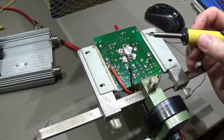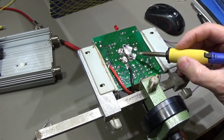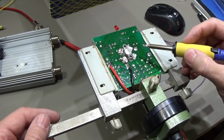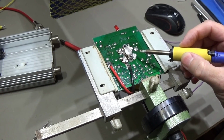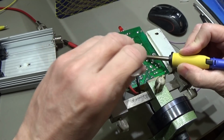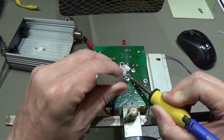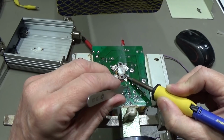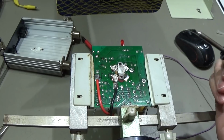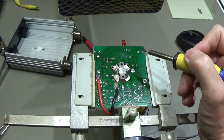The next step is then I take this blade tip, as you can see, and then of course I try to get under the leads to lift them a little bit, and that makes it easier to really get those kind of transistors off. And when you already have worked a little bit through, I don't know if you really can see it. So you see I really can go underneath, and then I can get the lead free to finally remove it. So that is the process. I do it now, of course, at all our leads, and then it should work.